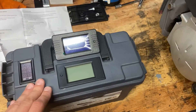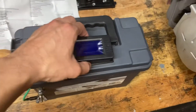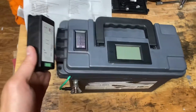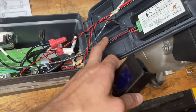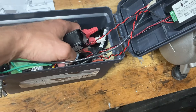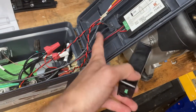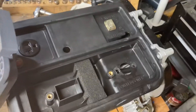So I think what I'll do first is take the old one out. If I'm lucky this is gonna be the same footprint as the old one - and it looks like it is - so it should be a direct replacement. I'm just gonna reuse the existing wiring on the interior: it's just four wires, two for the voltage measurement and two that go to a coil that goes around one of the AC wires to measure current. I'll drop this right in with the existing wiring and then start working on the generator.